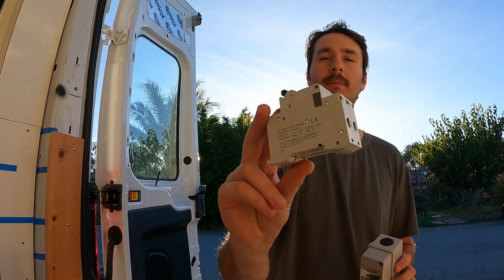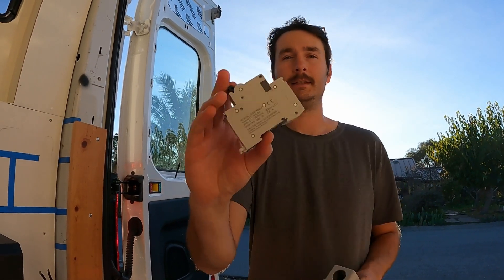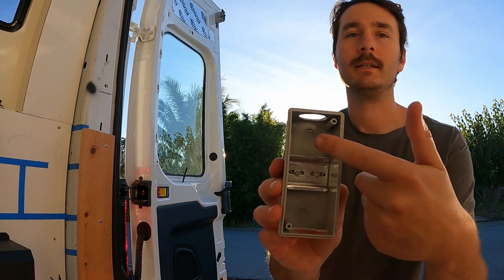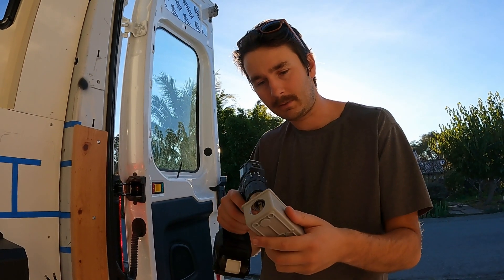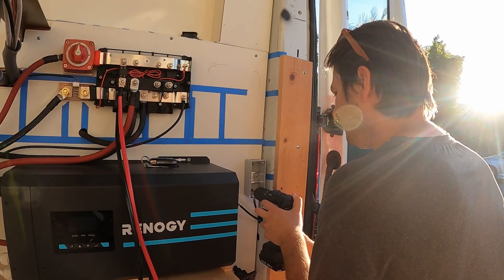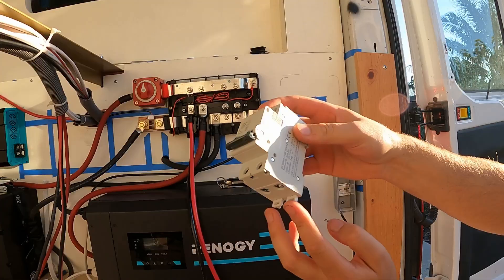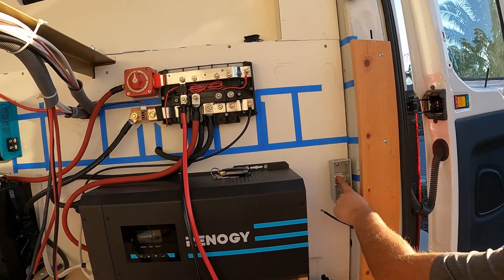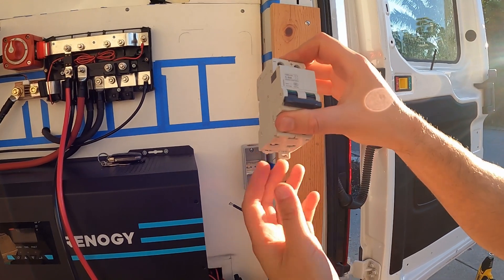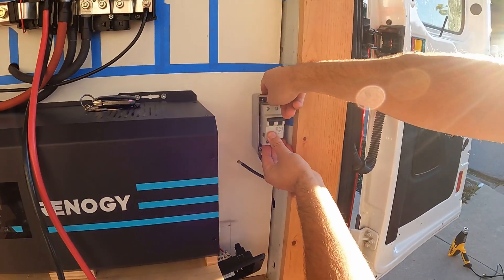This is the breaker I was just talking about — it was already in this breaker box. I've seen a lot of people use a five-way one, but we found a two-way. You only need to fit a two-pole breaker in there, and we figured this would work, and it does. First thing I'm going to do is drill through this so we can mount it. Then you take your breaker — it has these little clips that you put on this rail. You do the top side first, and then the bottom side clips in. Like I said, we're mounting it upside down.